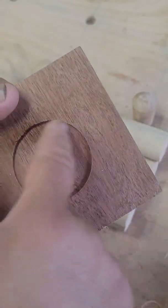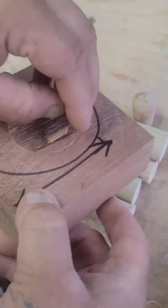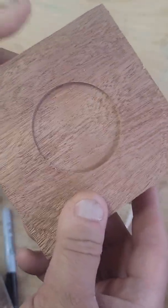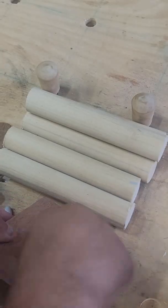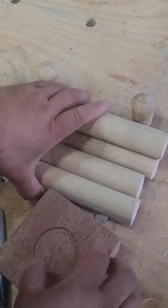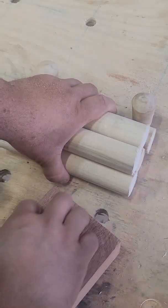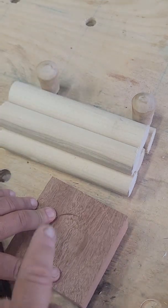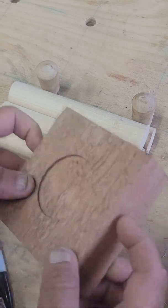The solution is to make a recess. The jaws of the chuck both compress on a tenon and expand on a mortise or recess. The benefit here is, although you have the same weakness going this direction, with the expansion, you have the stack of grains bundled on the sides, and you get a much more firm hold. There's one more way to deal with this problem that eliminates all these issues, at least on the piece you're turning.